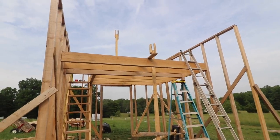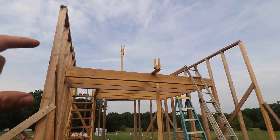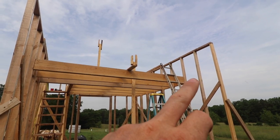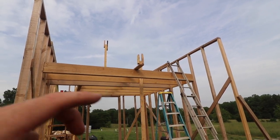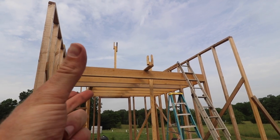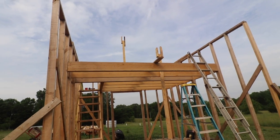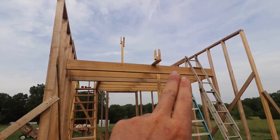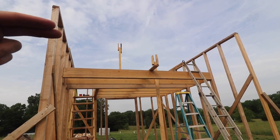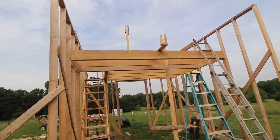What I just had to do is double up that front joist, like I mentioned, but it took some doing. The one that was there was crowned pretty bad, so I had to use the forks, get this one raised in place, get it started on one side, use some clamps, pull it into alignment this way, and then squeeze it together this way. It's riddled with nails, but that front face of that joist isn't going to be showing in the end, because it's going to be a wall built flush, and that wall, whatever it's sided with, will come down to the bottom of those joists.